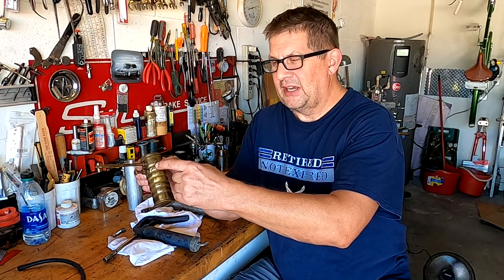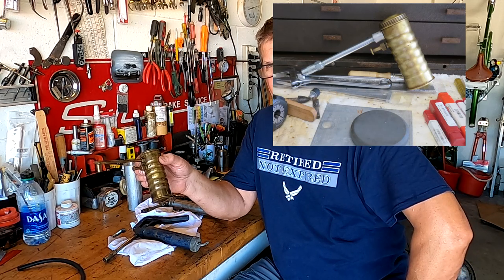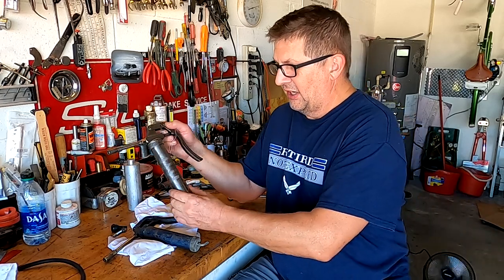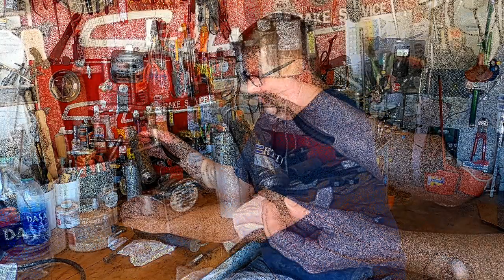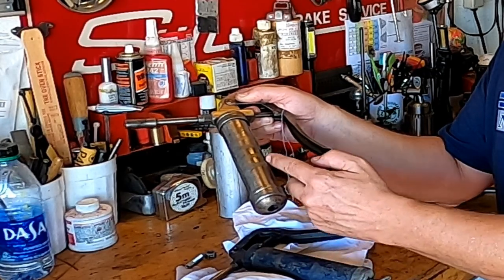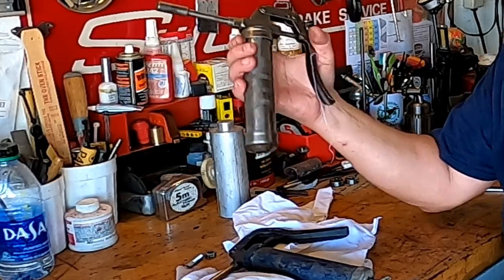So I came up with another solution a few years back. Originally I took an eagle-type oil can and put an adapter in it with a greaser nozzle at the end and used that, but my daughter had a hard time pumping it because it's just your trigger finger. So I decided to step up, add a little capacity and ease of movement. I built this one - I took a grease gun, gutted it, put a rubber hose in the inlet port, got rid of the spring, and put a wheel valve stem at the bottom. You just put a little bit of oil in, add a little air pressure, it pushes oil up through the rubber line, and when you squeeze it you lubricate your machine. This lets you stay square on the grease zerk, do it with one hand, and get up into odd places.